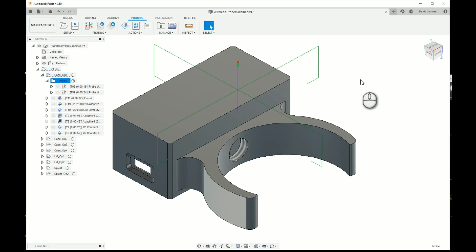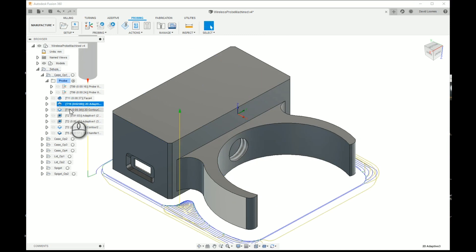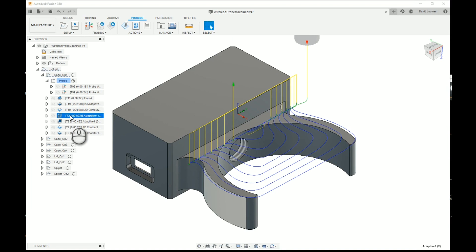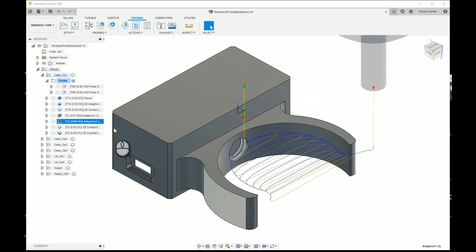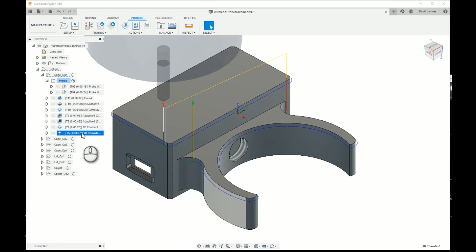With the probing out of the way, you can actually get on and do the rest of the machining. Op 1 is nothing special - it starts with a facing op, then a roughing pass to go around the overall outline, and a 2D contour to clean it up. We have an adaptive to remove the large amount of material below the spring - we're actually looking at the bottom of the case. I want to chamfer both sides of this, and due to the way it's clamped in the second op, I have to leave the centre area of this spring solid. So I'm using an adaptive to clear just enough height-wise so I can put the chamfer on and leave that section solid, then finish off the front and put the chamfers on.